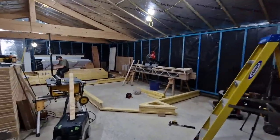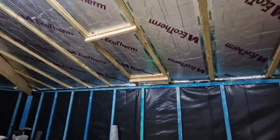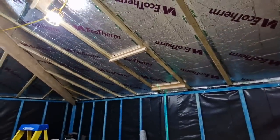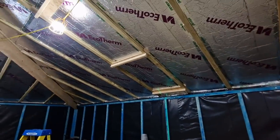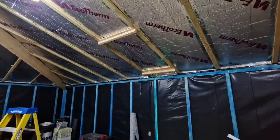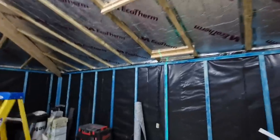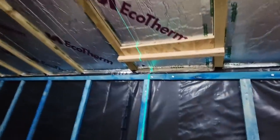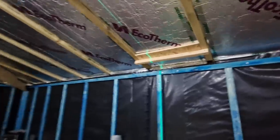I've got some grounds in the ceiling up here — two lots of grounds. There are grounds which are going to be behind the plasterboard, and then there are secondary grounds which are temporary, which catch our head plate. I'll screw my head plate into that, build my stud, and then when I put my plasterboard in I can slide them out, put the plasterboard back in, and then screw the actual stud through the plasterboard into those OSB grounds, which are at the right level behind the plasterboard.